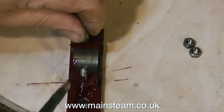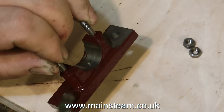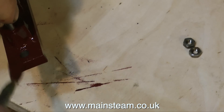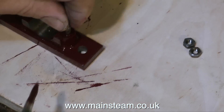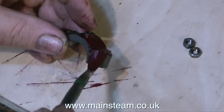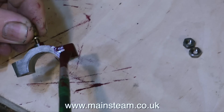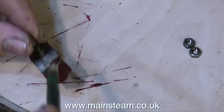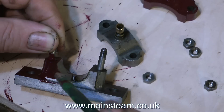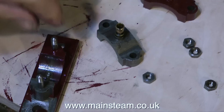He continues: other problems include the sole plate being approximately one-eighth of an inch short down its length, which means the cylinder is sat about a sixteenth off centre to its boss, and a discrepancy on the other side of about one-sixteenth of an inch, whereby the main bearing is not central to the two lugs on the cradle it sits in. Again, this is due to casting shrinkage, and to add yet more misery for the machinists, they are also slightly bowed — crap pattern again. I'd better put a quick disclaimer in here: these are not my thoughts, these are the thoughts of a viewer. In the case of this specific engine I can't even be sure that these are Stuart castings — they could be cast from other Stuart castings. Some of them are good and some are not so good, but from my experience Stuart castings are generally pretty good.